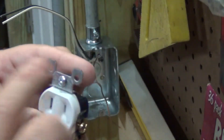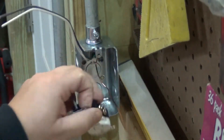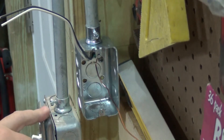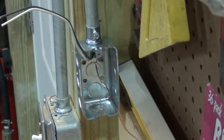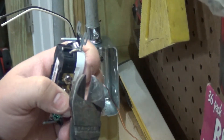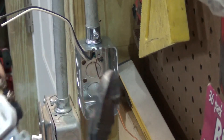Now we're gonna trim off these ears right here, because when we go to put this into the junction box it'll stick out the edge of the box. This style is a little more forgiving, but on this other one you do have to trim it off, and I'll show you how to do it in this video — it makes it a lot easier. Get my wire cutters. You'll see a line right here — I just trim them off. Easy as that.